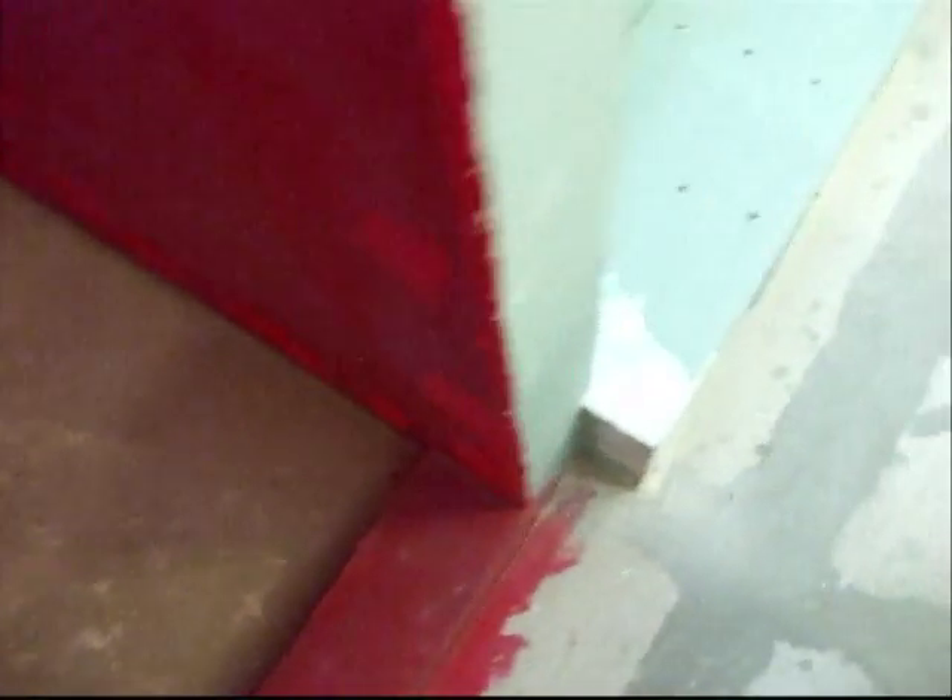The framing that I always do on my niches I'm going to do today — put the tile on the inset, do it around the edge like I always do. Let that set because all the field tile is going to get wrapped around it, so that has to go first and dry overnight. And then of course the floor tile — I'll put that in, and that has to dry overnight and be grouted before I set the wall tile. So that's where we're at now and I'm ready to get started.